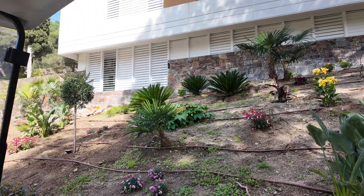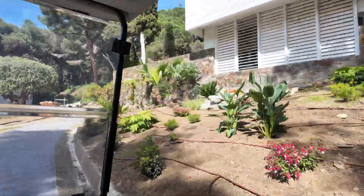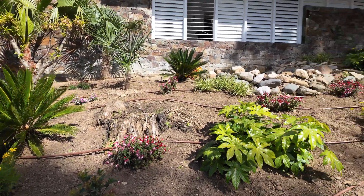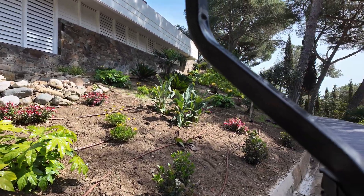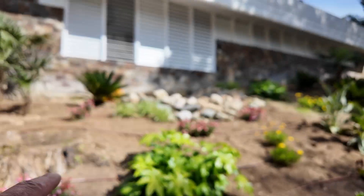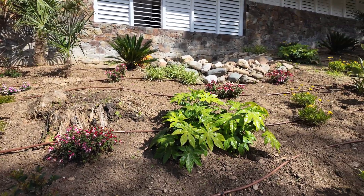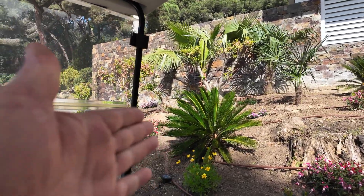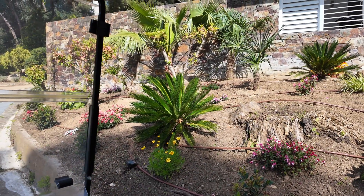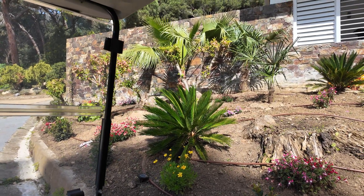The land is huge — this area is around 400 meters. We cannot do the irrigation with a wire system because nobody wants to dig kilometer-long trenches on the side of hills and between rocks and between really big trunks and roots. It's almost impossible. So there is no option to send a 24-volt signal on hundreds and hundreds of meters in different directions. This is why we chose this wireless option.